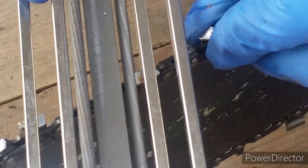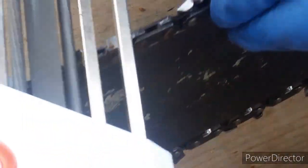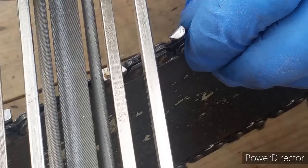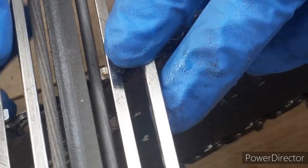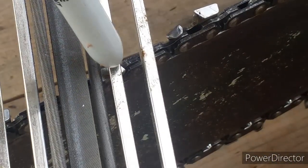Here's a closer look. You can see guide number one and number three resting on top of the cutting teeth. To properly sharpen the chain, make sure your file is aligned with the chain tooth — you can see everything is lined up correctly. When you push it forward, apply pressure, and loosen up a little when you pull it back. You can feel it removing a little metal from the top and side of the cutting tooth. You know it's sharp when you run your finger through it and it catches onto your skin a little bit.